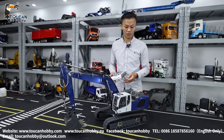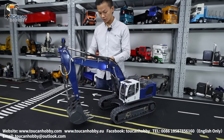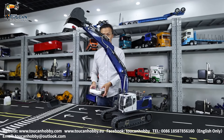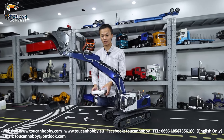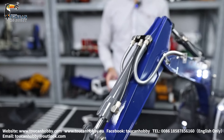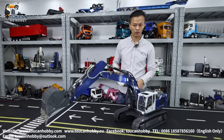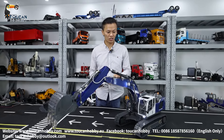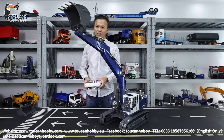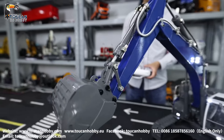This one already makes a mixed control for the pump. And for separately, you can start the pump here. And for mixed control, no need — you just control the arm and bucket. Let's first move to the most up position. That's the up position. Let's go down, make a dig in. Now the pump is 80% running. So if you want more power, it can increase a little more, but it's not so safe for the hydraulic system. It is suggested no more than 80%. You see the speed and the power — it is enough. If you insist, you can increase a little bit more for the hydraulic load.